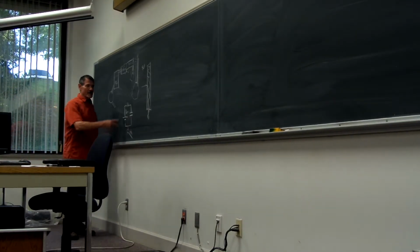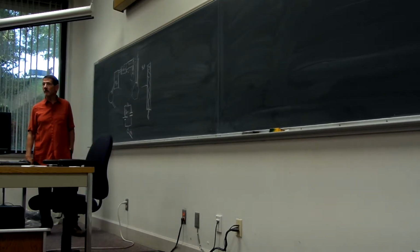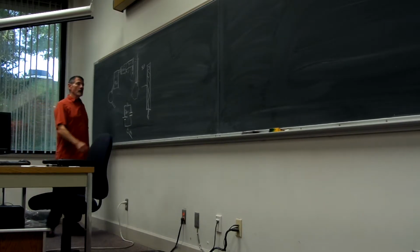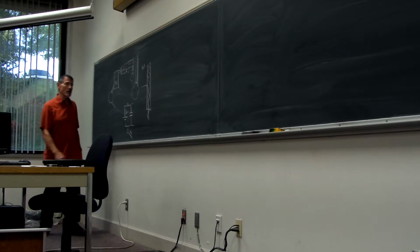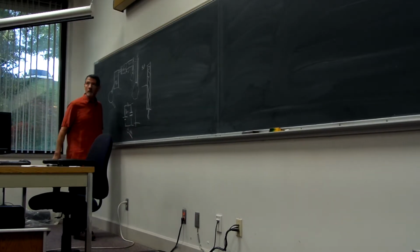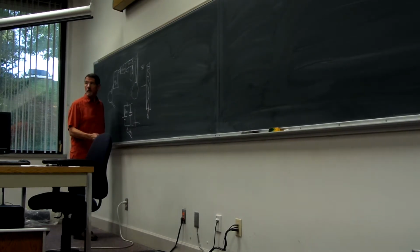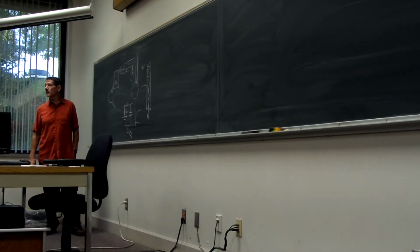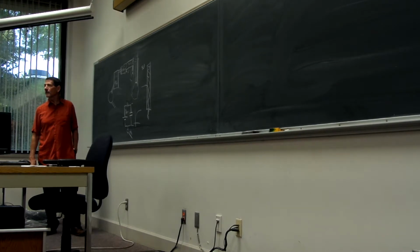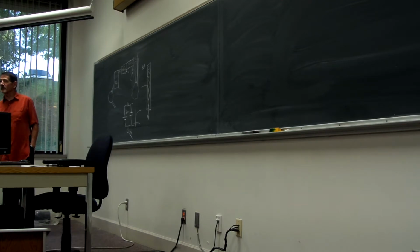All right, so with this system here, first order, second order system? First, right? So we're really interested in the pressure, the voltage across the capacitor. What's that going to do as a function of time? Increase, how? Exponentially, okay. Time constant is given by what? Time it takes to get to 63% of the final value. RC. Thank you, RC.